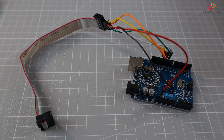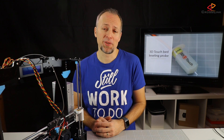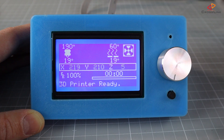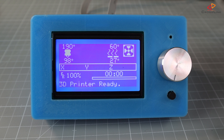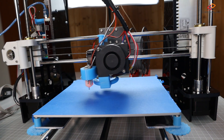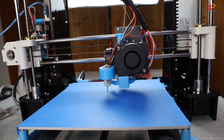If you'd like to know more about how to flash your firmware using an Arduino, please watch my how-to video about it. After flashing the new firmware to your printer, you are finally ready to do the calibration of your probe. Let's get straight into it. First, let's preheat everything using the preheat PLA function to get everything warmed up and expand it how it would be in a real printing situation. Then let's first try to auto-home the printer and see if that works fine. The printer should put the nozzle in the middle of the print bed and use the 3D-Touch to detect the end stop. Looks fine.